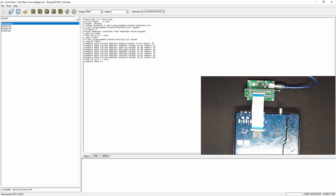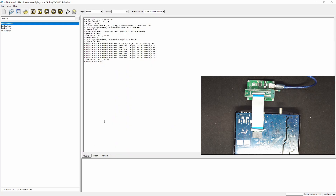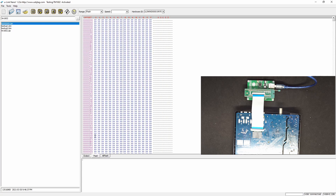It has several bit errors here. Sometimes NAND flash has bad sectors. Let's try to erase it and see if it is fully erased. If you find some non-FF blocks after erase, that means there is a bad block. This is erased and empty, so let's try to verify. This flash does not have any bad block.